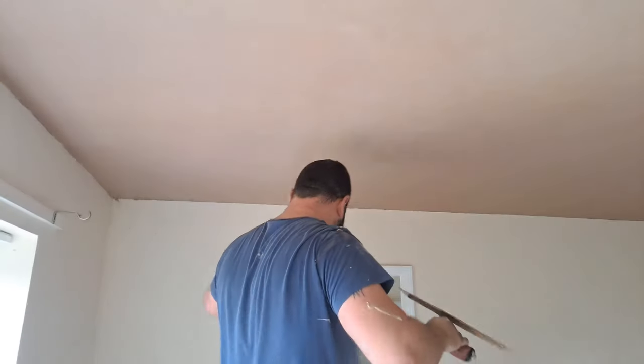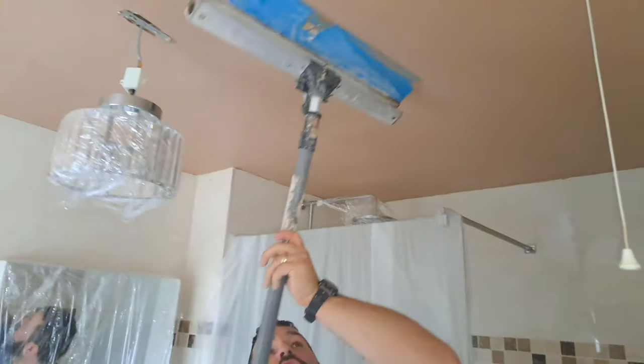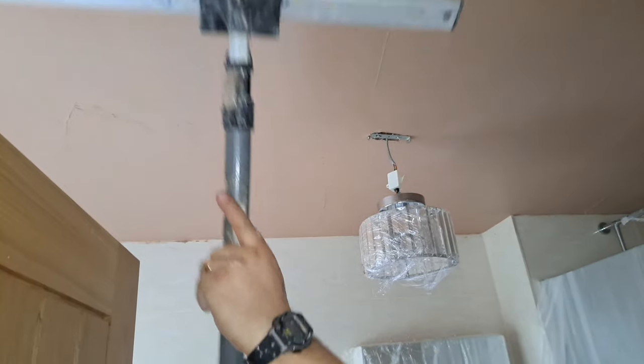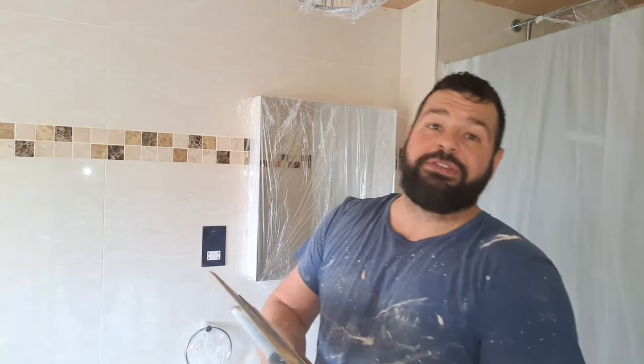Second wet trowel on ceiling one. You've got to make sure you get the system right - I definitely recommend using the little chart so you know where you are at all times. That's ceiling one second wet trowel done. Now we go to ceiling two to flatten it, then go to ceiling three to flatten that one. What you're doing is taking advantage of the timings with plastering. After your second coat there's a window of opportunity to put another bit on - as you go further down the set there's more time between trowels, which gives you the opportunity to do this.